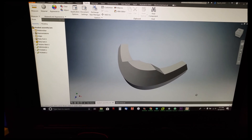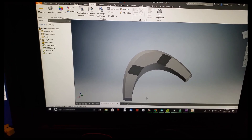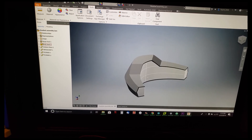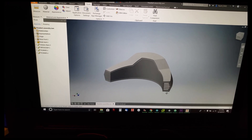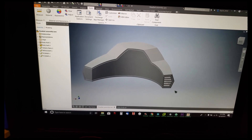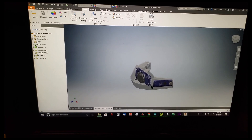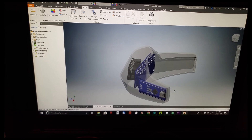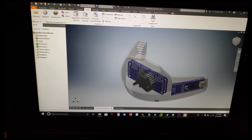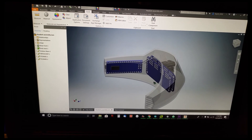I've made some tweaks to the design. I actually decided to add back in a little notch up here because I needed the space for components inside. We've got our front piece and our back piece that'll slide in. USB port will be on this side, and ventilation on the other side with some cool-looking vents. Making the entire thing transparent, we can see the internals — Arduino here with USB port sticking out, a couple of PWM drivers for the LEDs along the front edge, and the pressure sensor with its tube running to the mouthpiece.